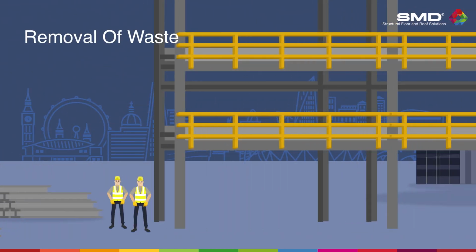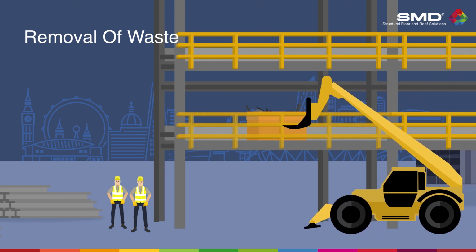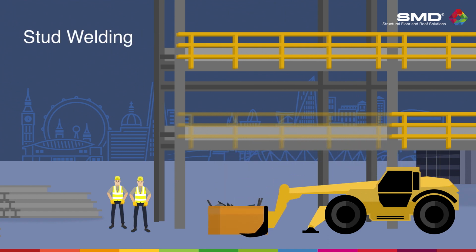A level of waste will be created by our decking activities on site. Due to high health and safety risks of cuts and abrasions, manually removing waste via stairs is not acceptable. An area where waste will be collected should be agreed and removed using a pallet or skip. The removal of scrap from level is the responsibility of the client.